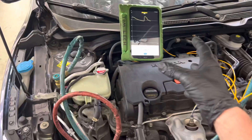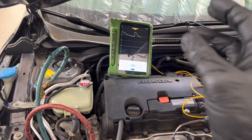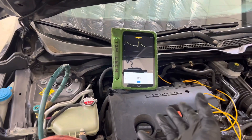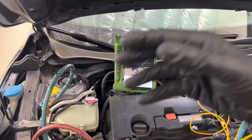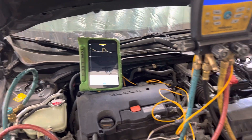This also goes with the customer's invoice or receipt to prove that you have performed and reached a certain level of vacuum, to assure the customer that all air has been removed out of the system and as much moisture as possible — on top of your superheat, sub-cooling, your pressures, and your data-logged trend line of temperatures.